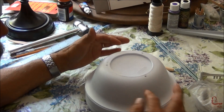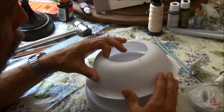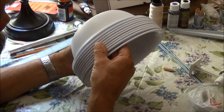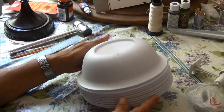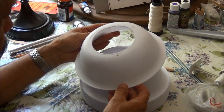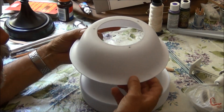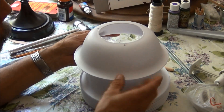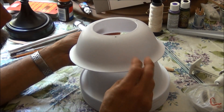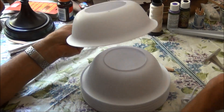Where I've got it is in the shade, but every once in a while some light will come through and touch the sensor and heat it up. This shield will protect against that. I've seen several people do this in different ways and you can buy these commercially, but I want to do this inexpensively. I decided to use plastic because it's not a good thermal conductor. If I made this out of pie pans or something, the metal conducts heat more readily into where the sensor is.